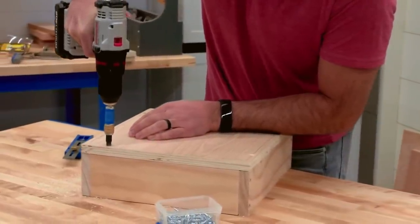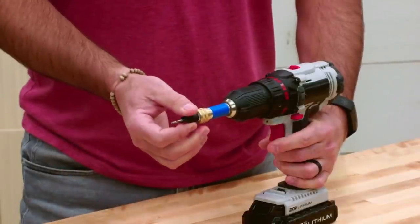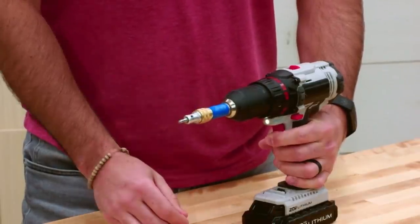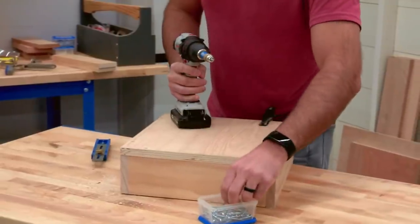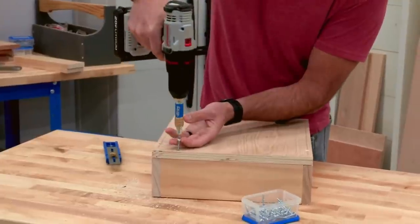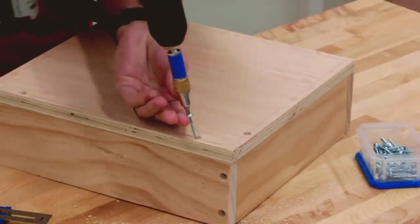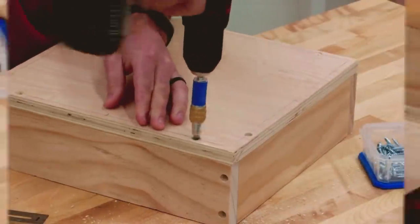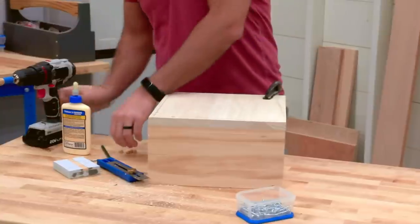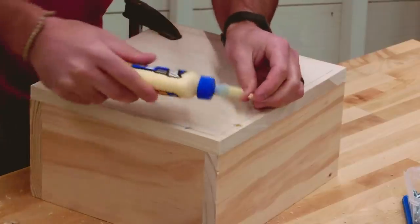This makes it easy to drill the pilot hole and counterbore in one step, then just flip the insert around to expose the number two square drive bit, and drive the screw home. The square drive prevents bit slipping, and the case-hardened screw drives in easily but grips tight for tremendous holding power. You've easily created a strong joint with a recessed screw head. You can make the counterbore just deep enough to recess the screw, or make it deeper and plug the hole using a pre-made plug or by cutting a 3/8-inch dowel.